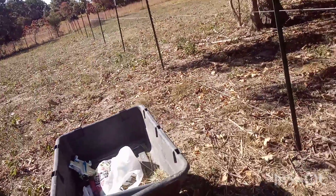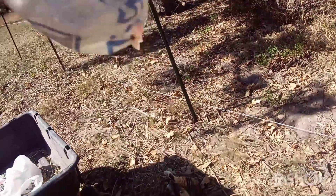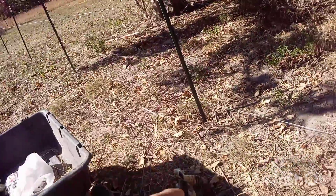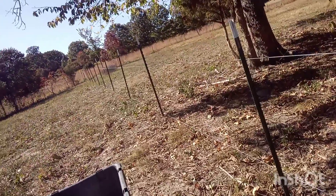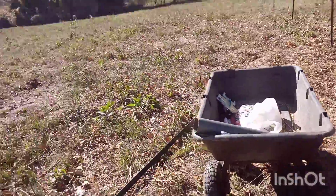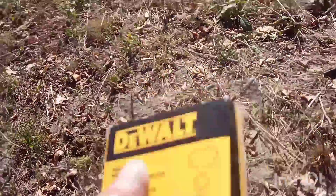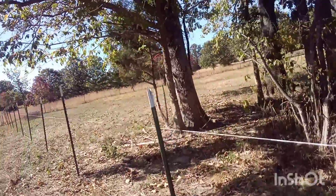After I release the tension down here, we're going to use fence clips to attach the tension wire where we want it. Then we'll tension the fence and use hog rings to tie the fence to the tension wire, and fence clips to attach the fence to the t-post. That should give us a good strong fence. They're called hog rings — I've never seen them in a box and never used this tool before. It's brand new for me.